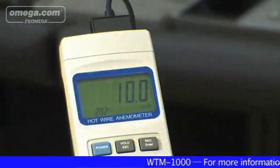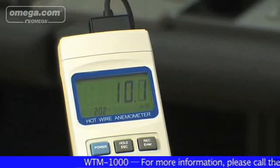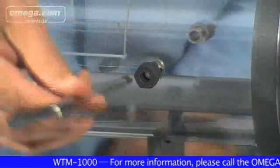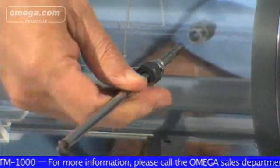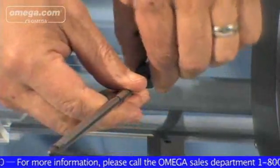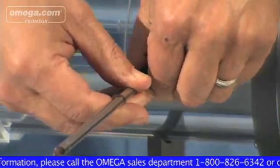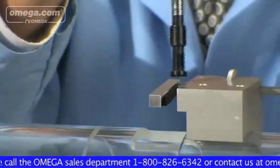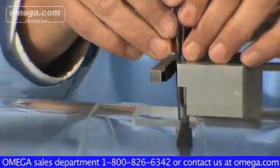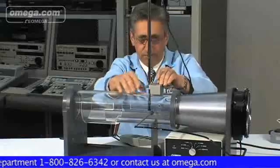To get the most out of the WTM-1000 Mini Wind Tunnel, be sure to read the owner's manual. It fully describes the recommended do's and don'ts for optimal usage. Installation is important with the WTM-1000. When installing the wind tunnel, be sure to have ample space — 5 feet minimum — on the front intake and rear exhaust of the tunnel. In addition, ensure it is placed away from open doors, windows, or AC vents that could induce wind drafts on the wind tunnel.